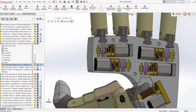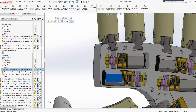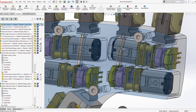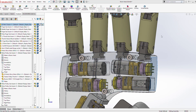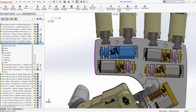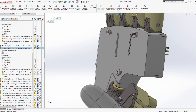One final design point: the positioning of all four motors driving the index, middle, ring, and pinky fingers. Two of them — for the index and pinky — are positioned as demonstrated in this video, and the other two are positioned slightly below them. In that case the tendons can't run straight through the other motors, so they run through slots on the front of the palm, with covers added in the future to keep things neat. This design isn't really going for maximum gripping force — the aim is to make a compact bionic hand whilst fitting as many degrees of freedom as possible for dexterity, particularly for the thumb and wrist, which I plan to cover in my next video.